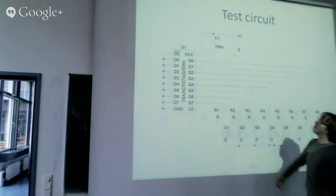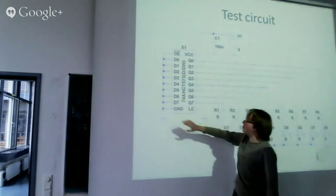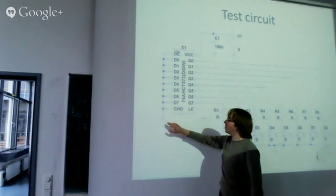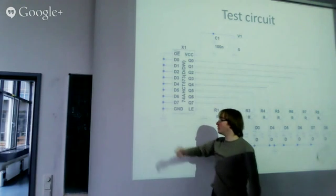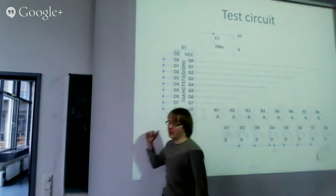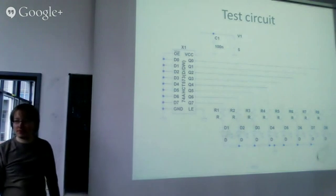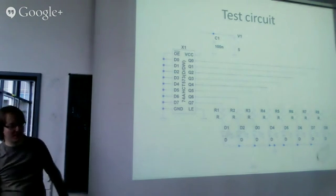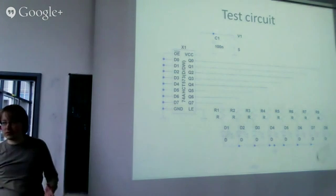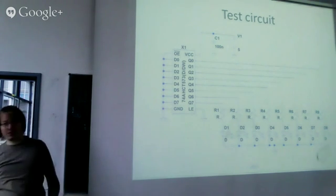Of course, I have an inductivity between the minus of the power supply and this point. But I cannot include an inductivity between the Earth and this point. If I connect the Earth to the case, I cannot put an inductivity in between. That's my problem. "If the Earth comes from your Ethernet connector, you can put an inductivity between the Ethernet connector and the rest of the board." But the Ethernet connector is directly connected to the ground on the Raspberry Pi. "But you mentioned that the Raspberry Pi isn't affected, so you can put it between your board and the Raspberry Pi. That would be possible."